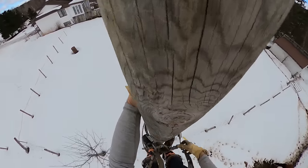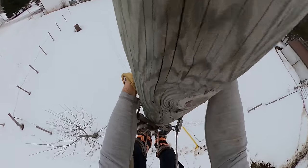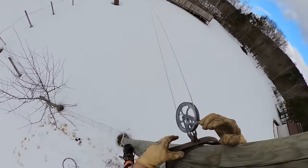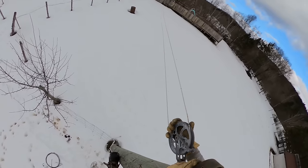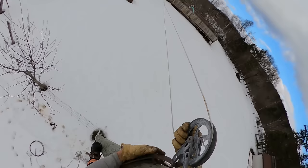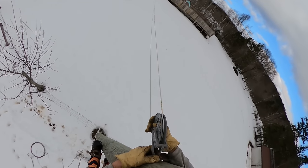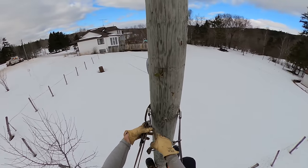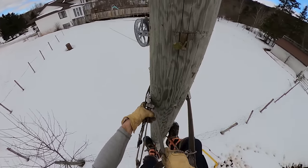The first time I went by this clothesline I simply lifted it off. The reason is the clothesline is not secure enough to rely on with my secondary belt - if I slipped and my secondary belt fetched up on that clothesline, it's not going to hold my weight. That's why I chose to just lift it off. I'm going to go talk to the customer about the pole, so I didn't completely remove the clothesline yet.